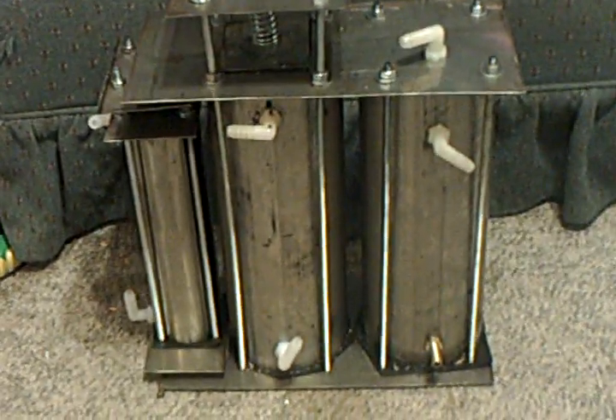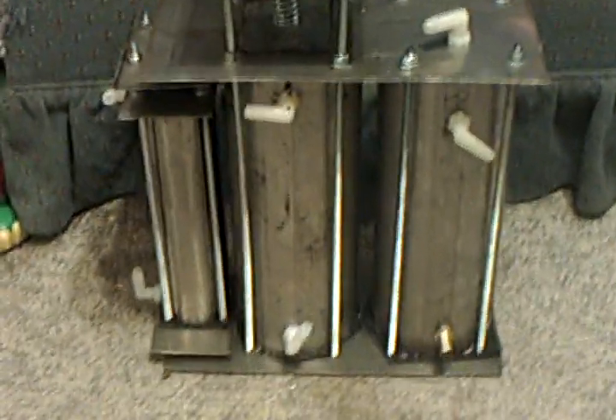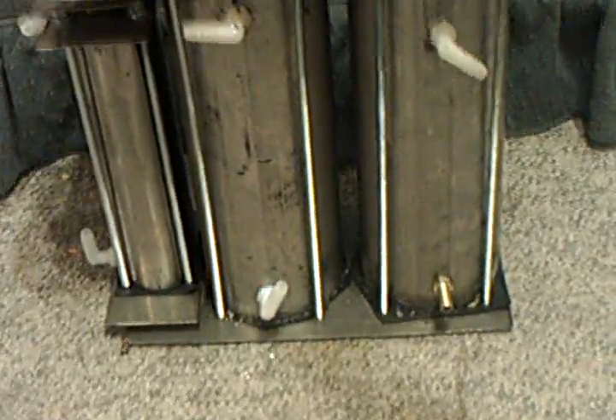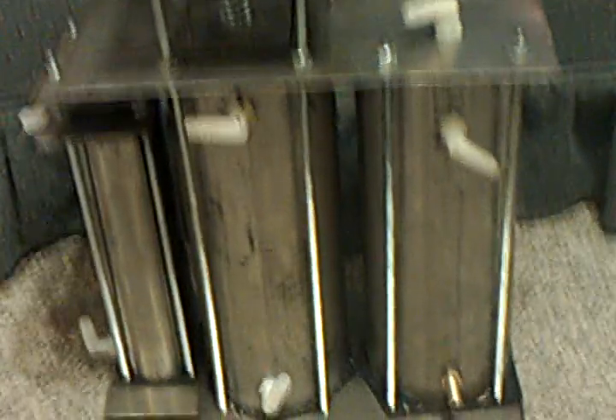I haven't tested this yet — I ran out of time. It was starting to get dark when I got this far with it today. The two primary pipes are 12 inches tall, the secondary bubbler is 10 inches tall. The secondary bubbler pipe is 316L stainless steel. The two main big pipes have an inside diameter of 4.25 inches, and they're 14 gauge stainless steel. The tops and the bottoms are 16 gauge stainless steel.